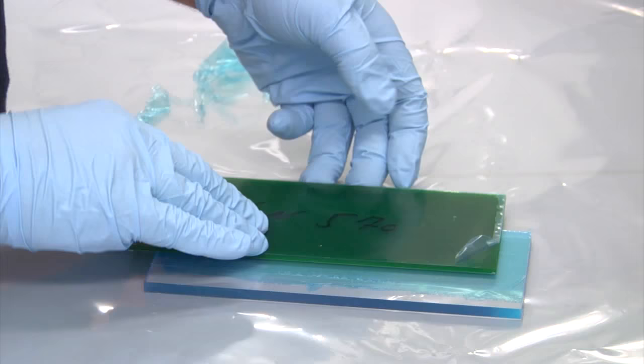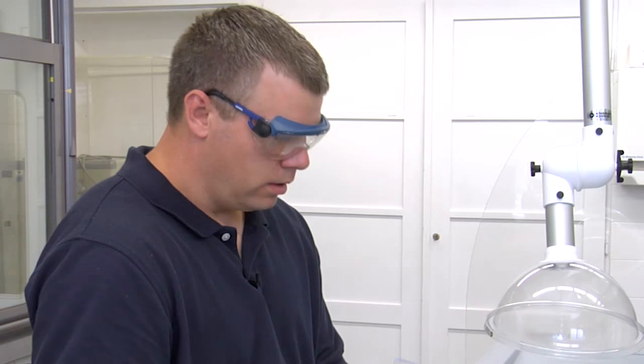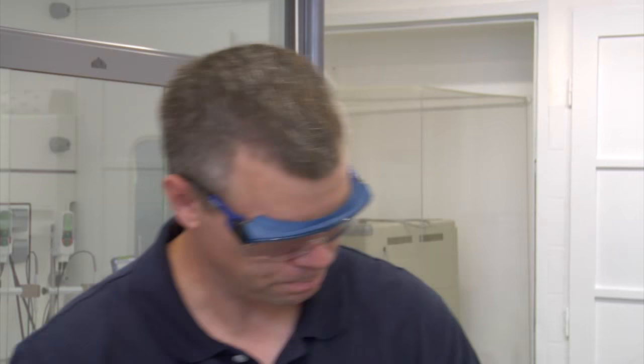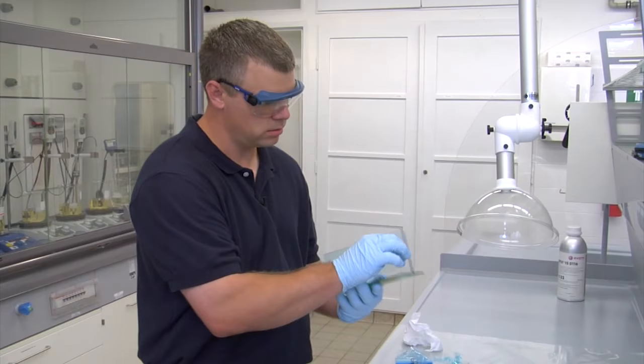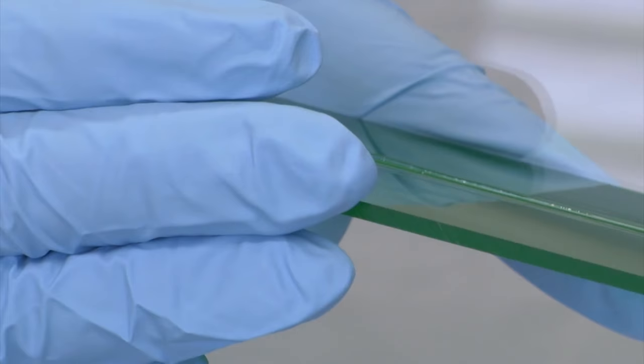On the adhesive side of the green Acrylite sheet, the masking is removed completely. Now the adhesive is applied smoothly and in a thin layer. Now that we have applied our bead, we can set the joint. With the material placed, the joint will set up in 30 to 90 seconds, depending on the conditions in the room. The joint is now set, so we can remove the masking. After about three hours, the Acryfix product is fully set and ready for further fabrication.